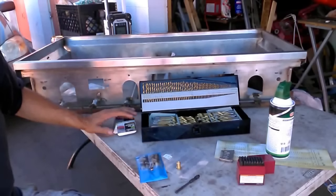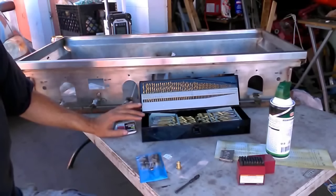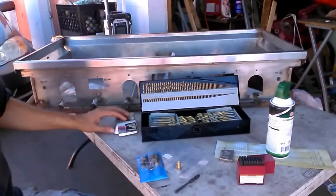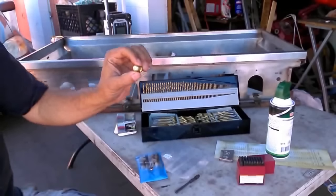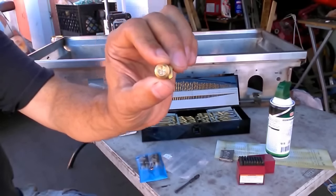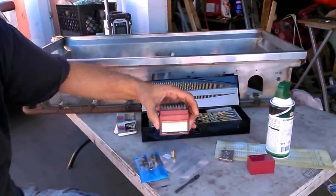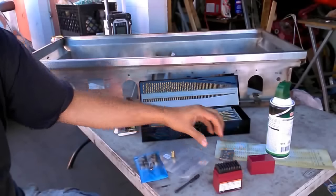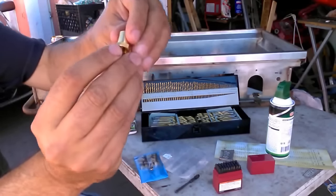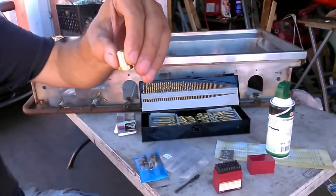There are tables available out there — the formula is about a foot long. I happen to be in the trade, so I know the numbers needed per the given BTU versus the gas pressure being fed in. I do these for my customers and supply these orifices as a courtesy for a fee — boring them to size. These are number 72 starter holes. Once I drill the orifices to the right size, I stamp a number on the orifice, usually on the shoulder, to show what size that orifice is. These orifices say 72, telling me that's the pilot hole size, but it's not the final size the orifice needs to be.